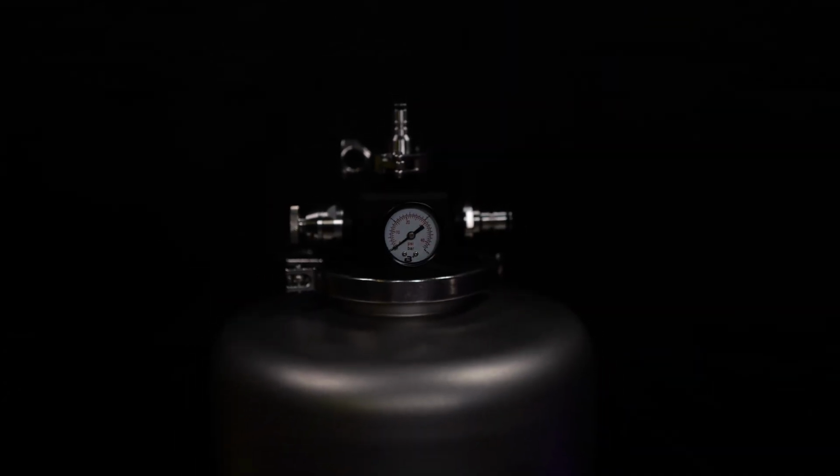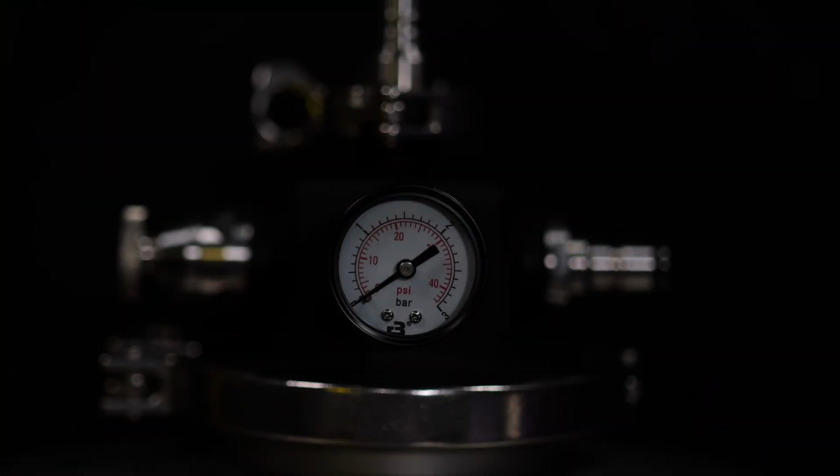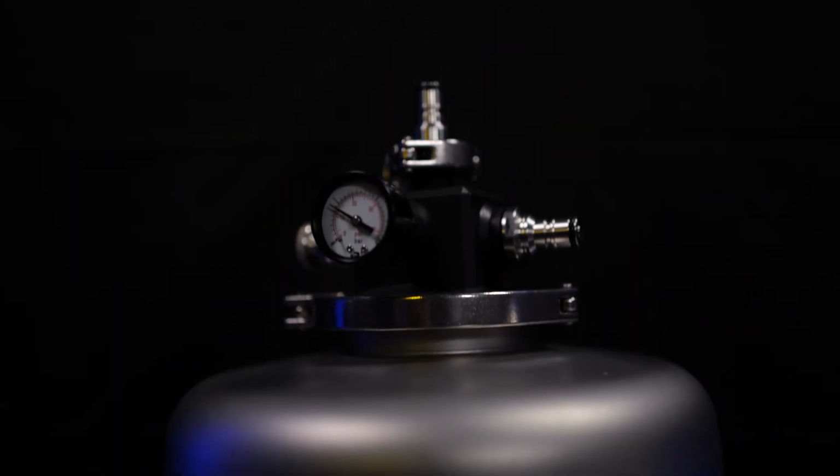One of the areas I would like to see improved is the pressure gauge itself. I really wish it had a more precise and finer scale written on there. What I mean is it's counting in too big of increments. I would like to see it more focused on actual homebrewing pressure increments that are commonly used. Yeah, you can dial in 12, 13, 9, 7 pounds, whatever you want, but I really wish the scale was calibrated for that finer control. I do get that the scale of it corresponds with the tank's full range of pressure, but I honestly don't see it being used in those full range maximum pressures for its intended purpose of homebrewing. The PRV is gonna kick in, honestly. So I would love to see Brewtools change this gauge out. And it's not a diaphragm gauge, and that's okay, because they're trying to be cheap here, or inexpensive, if they can. They're doing their best. But really change that text so it's more precise.